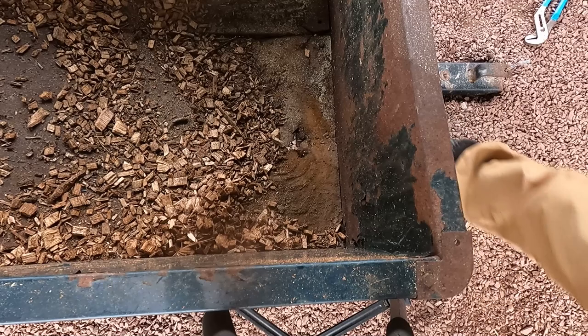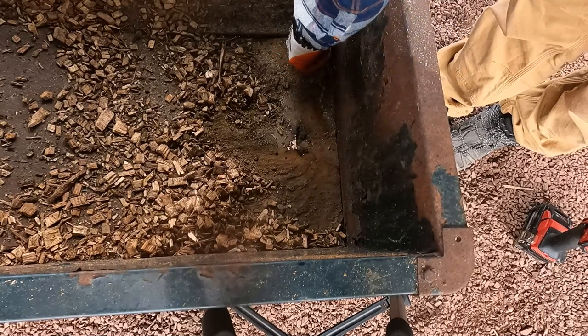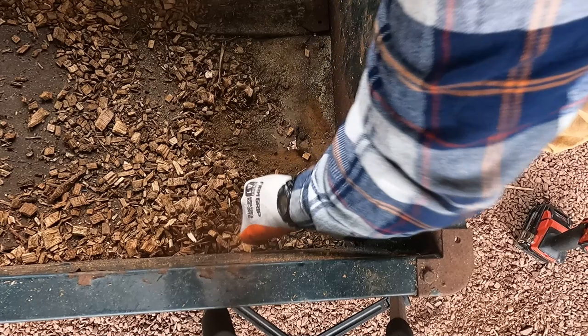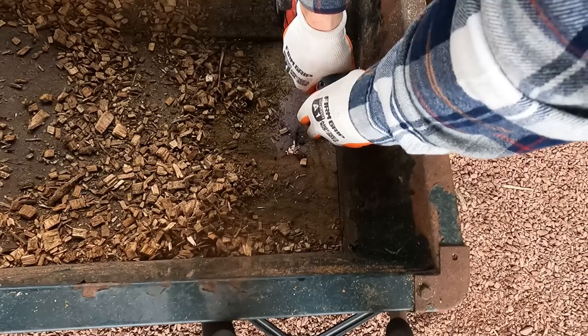There were some various areas inside of the trailer that had completely rusted out, like this area that you can see here, and there used to be a bolt and a nut there that was holding this down. Obviously, I can't go in that same area because there's no more metal. It rusted out completely. So rather than patching it, which would have been the right job with welding, I'm just going to relocate the bolt and the nut over into some solid metal, and that's where I'm just going to drill a hole, pre-drill it, and then set my nut and my bolt there.